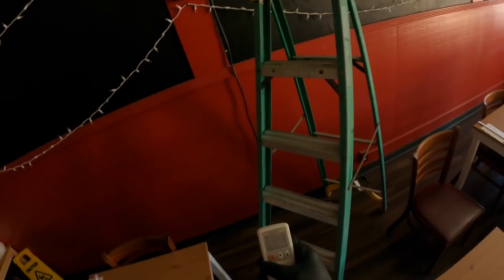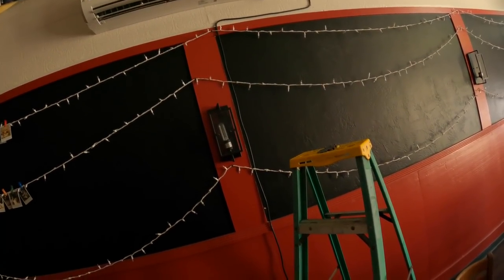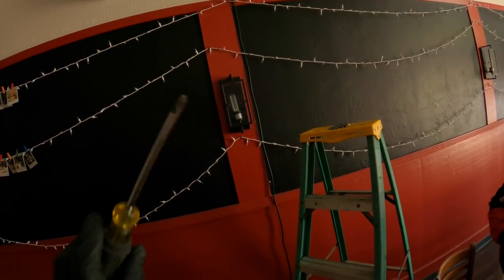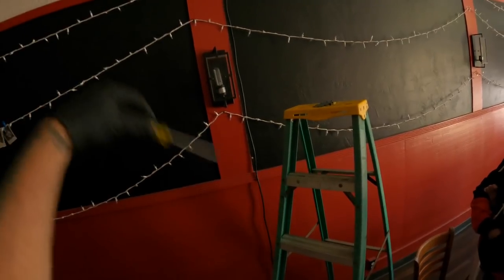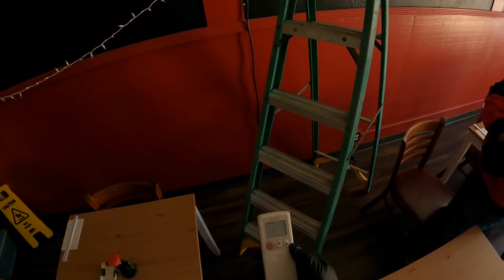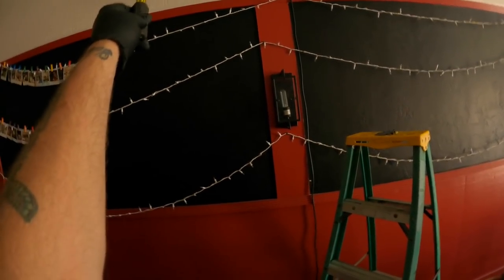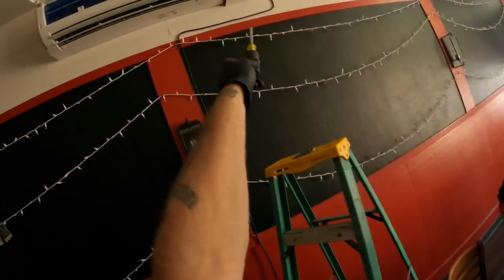Yep. So the condensate pump up there has a float switch in it, and a safety switch. If we're not pumping the water out, it doesn't want you to make a water mess in the building, so it shuts the unit off. But for right now, let's get a little bit of heat going. We'll get her warmed up, make sure everything works. Then I'll get my stuff off the roof. I'll have to come back down here and take all this apart and find it. Usually they stuff them in here somewheres.